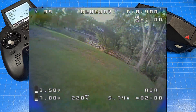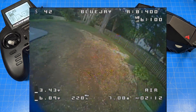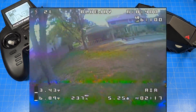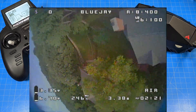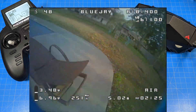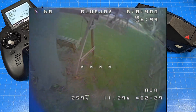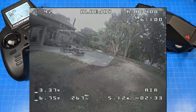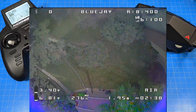I should stick to this quad — it flies very very nicely. I did retune it though, because after the first couple of flights my props got a little banged up and things were getting kind of unwieldy. You'd get kind of that shimmy because my props weren't perfect. Rotor Geeks tuned this kind of to the edge, and when your props get a little banged up or the quad gets broken in, you'll need to loosen that up. I can leave my CLI dump down in the video description if you want to use mine.